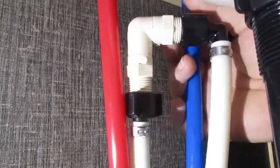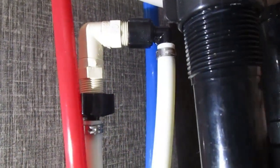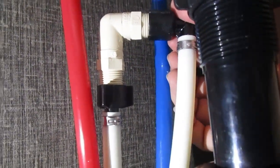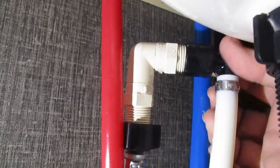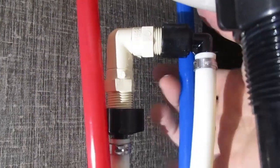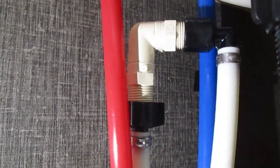Here's our fitting installed. All it does is thread right in there, eliminating the valve and putting a solid piece of pipe in place of that backflow valve. This should be really cool — I'm going to go flush the tanks and turn on the black tank flusher and see what kind of repair job we did.